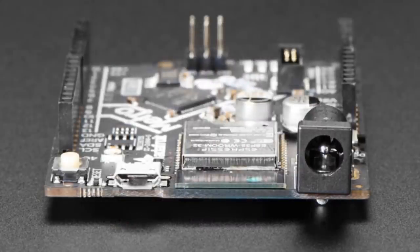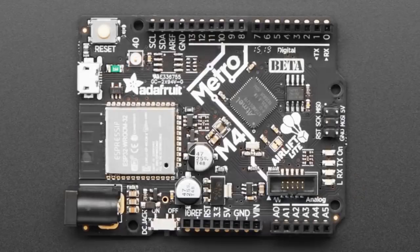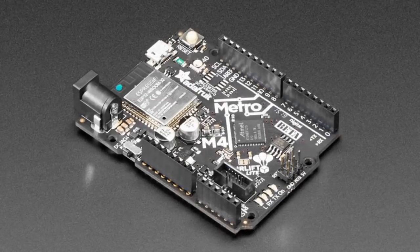There's an ESP32 module on there, which is the Wi-Fi coprocessor. Now the ESP32 doesn't have native USB, and it doesn't run CircuitPython, and there are other things it's not as good at as a native Cortex ARM M4. But why not combine them? The ESP32 is really good at TLS 1.2 — it handles certificates, has all those certificates burnt in already, has all the memory for buffering your sockets. You can grab data from the web. One demo I did: the ESP32 grabs MP3 audio data from a web stream, and then the M4 decodes the MP3 and outputs to the DACs. CircuitPython and the ESP32 are a super pair — you get the ease of use of Python, file system editing, and that powerful Wi-Fi coprocessor.